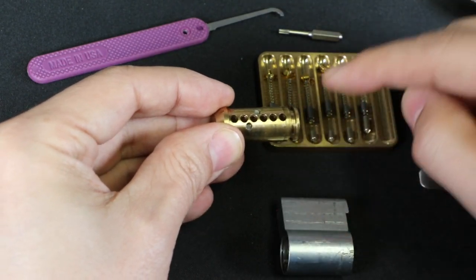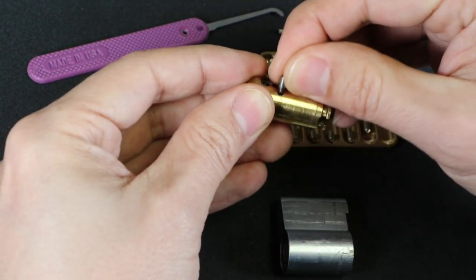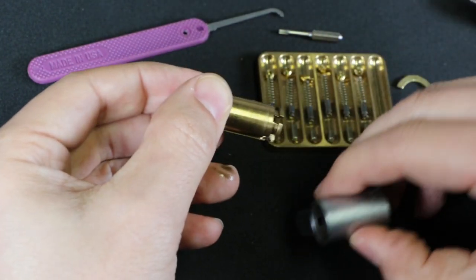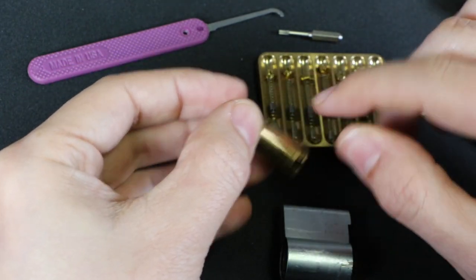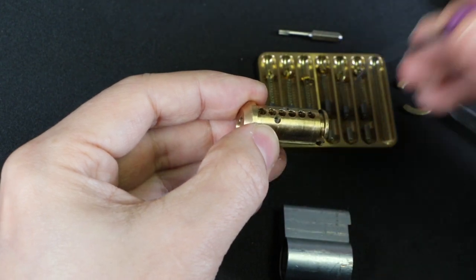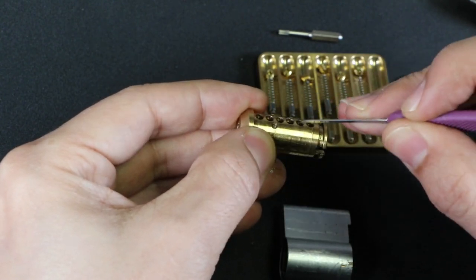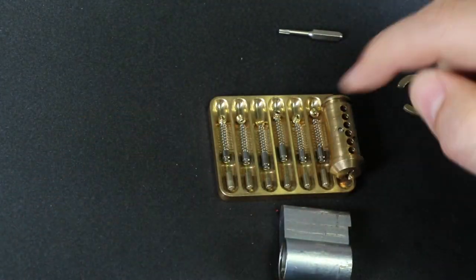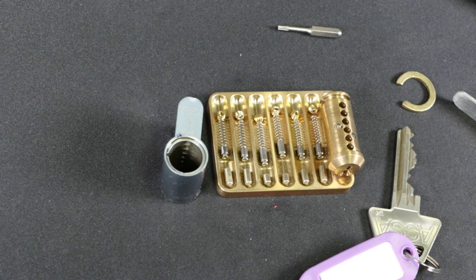So there's the plug. If you're gutting it through the plug, be careful not to drop one of these gin spools into an anti-drill hole — if that anti-drill pin's not in there, it can drop in deep and you brick it. You have to do some percussive maintenance: smack it down while pulling it out, using the momentum of the pin to keep it out of that hole. You can see there's one deep counter mill on each chamber. If it had two light mills, that would be a plug made for barrel spools, not gin spools — so make sure your plug is paired with the driver pins in your lock. That is the Assa 600 with gins — thanks again Georgia Jim for sending this over even though you knew this is not one of my favorite locks. Thanks everyone, bye.